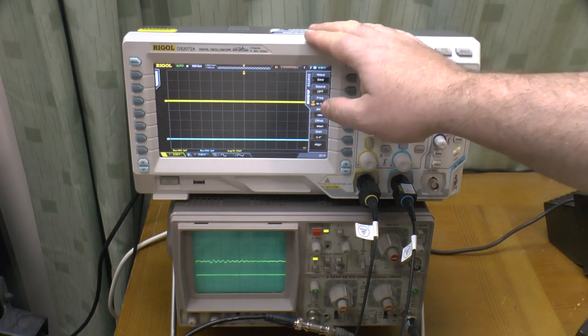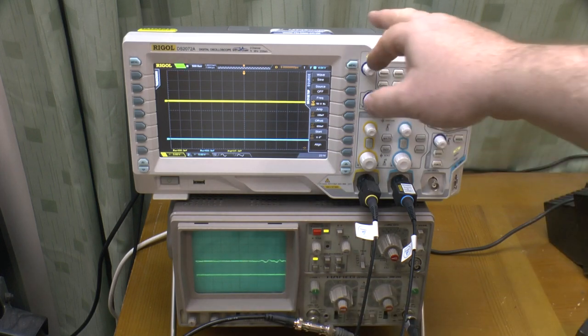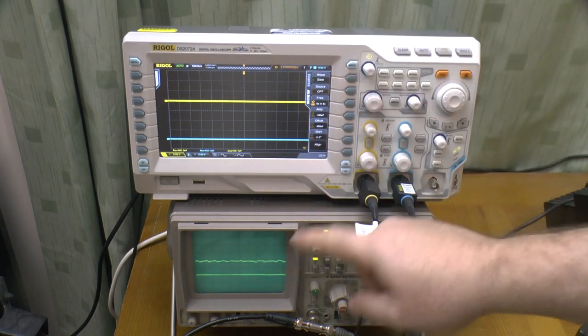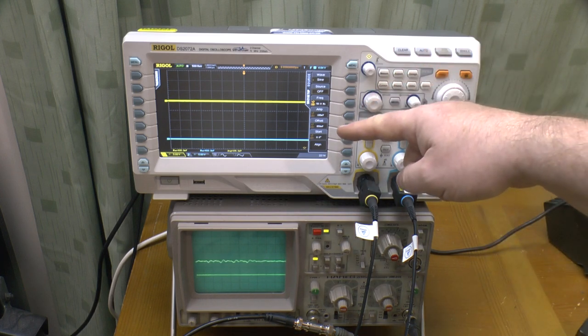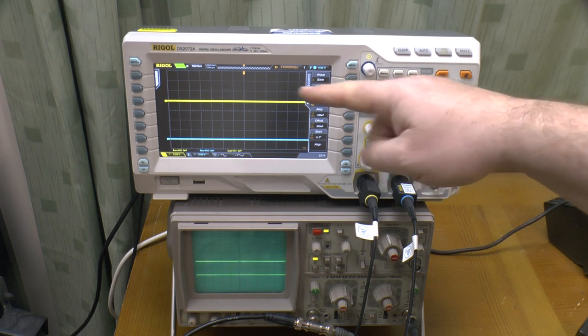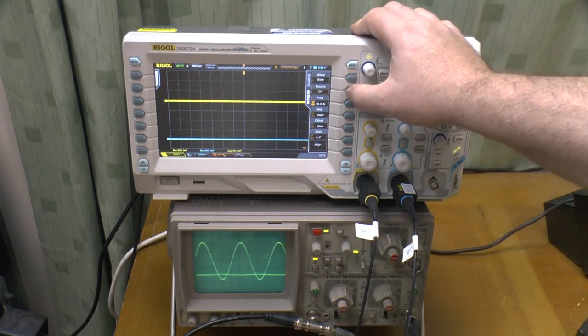I've also got the signal generator from the Rigol coupled in via a T-piece into here, so I can actually inject a false microphone signal from here. It's got a 650 millivolt offset because the unbiased feed from the microphone is actually biased. It's just not biased to the full microphone supply voltage. It's got a 0.65 volt bias to it. It's set for 100 millivolt output. At the moment it's 50 hertz, and if I turn this on, it'll replace the microphone signal with my own.